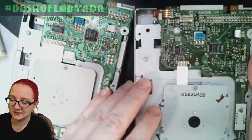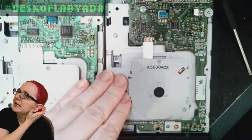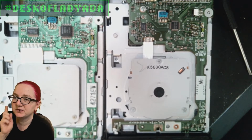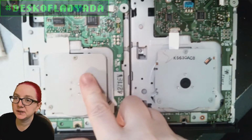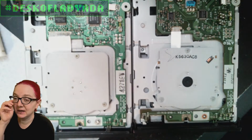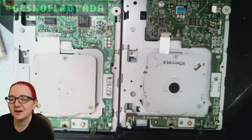That's not what I did, but this floppy drive is actually not working. It's not giving me an index pulse, although it's getting data out. And the motor's definitely spinning. What's weird is that normally you spin up the motor, you immediately get the index pulses coming out, and you get data. This one, the data's coming out, but not an index pulse. And I don't understand why.